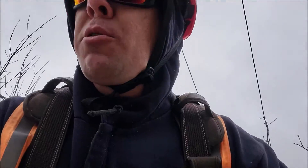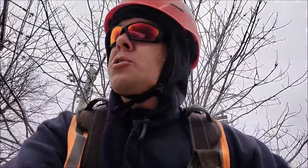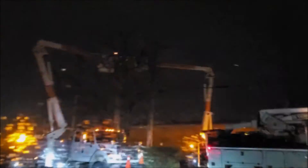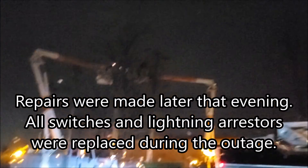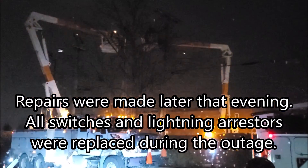Alright guys, we've got an opportunity to see how a hot spot shows up on the power lines. The thermocam is kind of like x-ray glasses for linemen. You can't allow these to give you a false sense of security either — there could be a crack in that cutout all the same; it may not be registering any heat if it's not tracking. We'll schedule a crew to get an outage on the go here and replace that lightning arrestor as well as that hot cutout door. In fact, we'll likely change the cutouts to a polymer while we're up there to get rid of those porcelain ones. Man, that wind is cold out there today. Thanks again for watching — don't forget to like and subscribe and we'll see you next time.